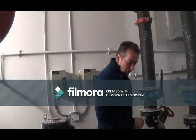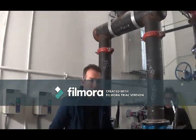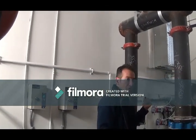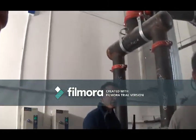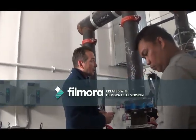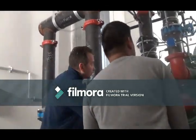Okay. In the wintertime, things will get drained out of the condenser water in the cooling tower. So we don't want any water to be exposed outside and freezing up. Also, the makeup water will be turned off and so forth. Nothing to do with the valving. You don't have to change any valving on here.